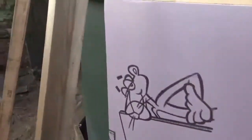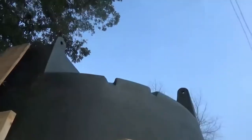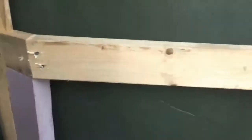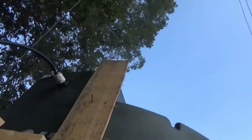I'm using four feet high, putting the second band at four feet for the first band, and then the second band will be at eight feet, and then I have a third band that will go at the very top — that will be for the roof. I'm wrapping it in about three-quarter inch oak boards; this will be the skin of it. I'll lift the board off the ground a little bit, and it'll tie all these bands together — I'll screw through this outside board to hold the bands all together. And up there will be a band at the top for the roof.